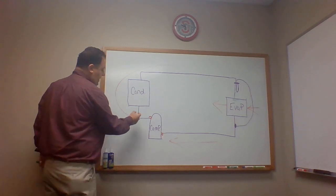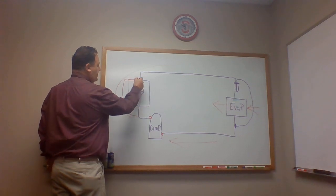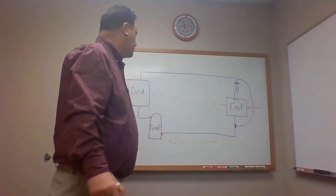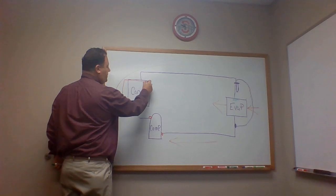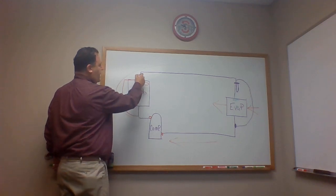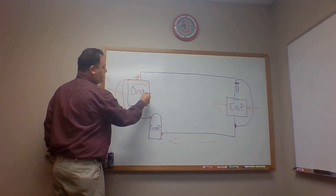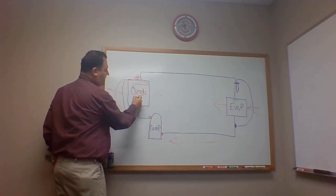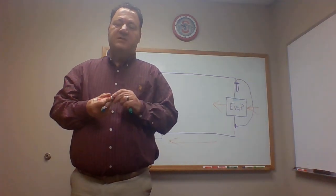Technically, by the way, this line, I'm going to move it for you, just so you get a good feel for this. It's going to enter at the top of the condenser. I've never seen it not be that way. If you have, please comment below. The reason for that is vapor is lighter than liquid, right? So as it comes through here and starts to reject that heat, that fan on top of there, that's not a very good fan, rejects that heat. We're taking the air from the outside, rejecting it out from the top. As it starts to reject that heat, there it is. The closer it gets to the bottom, it starts to condense into a liquid, right?